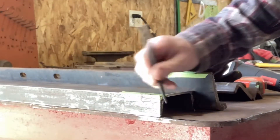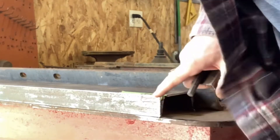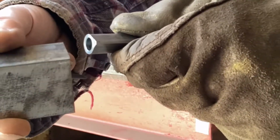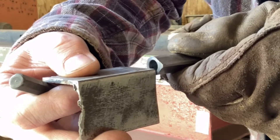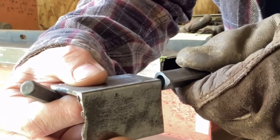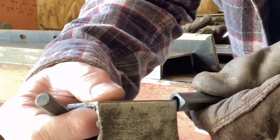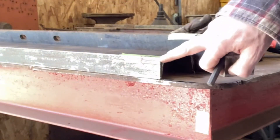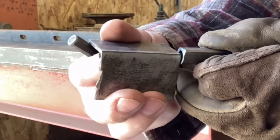I need to grind out of this corner and out of a corner of this here, to get this to pivot exactly in the center so it doesn't have a big gap when it folds up. You need to come in and split this in quarters, so that your base plate and your hinge plate pivot - basically you're splitting the two of them 50-50. Half of that 50-50, so you're basically just quartering this. This plate gets a quarter and then this plate gets a quarter. That way when it hinges, it'll hinge perfectly in the center.